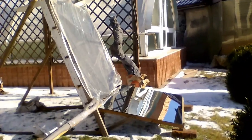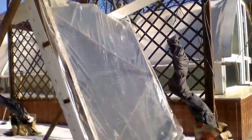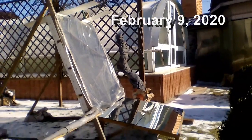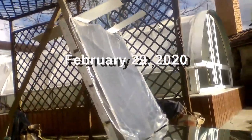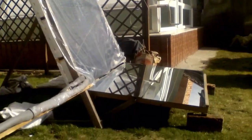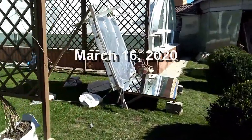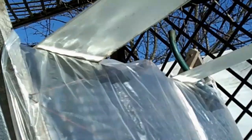Here we see the cause of the perfect coverage. In other words, I changed the vertical angle of the mirror. But it is obvious that soon this angle of the mirror will no longer be optimal, due to the gradual increase in the height of the sun above the horizon. That is why I changed the mirror angle again after 3 weeks, and we understand that a similar situation will be on the 10th of October, at the beginning of the heating season. Now I am showing the perfect coverage by solar radiation after the next step of changing the angle of the mirror.